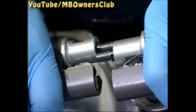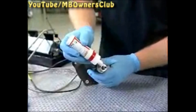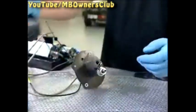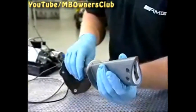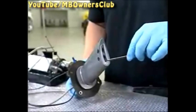For the final inspection, hold the two end pieces together — with us, everything's okay. In the last step, install the tail spoiler feet to the system. First, coat the thread at the cylinder with thread lock. Insert the feet very carefully. The guide rod may not damage the micro switch on the inside. Tighten the screw connection on the inside. The hydraulic unit is now ready to be installed.